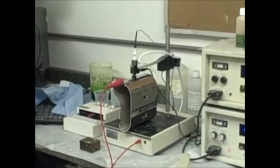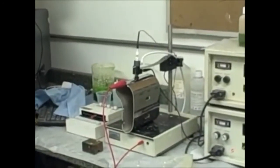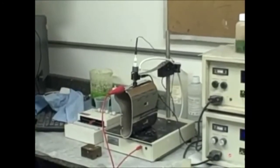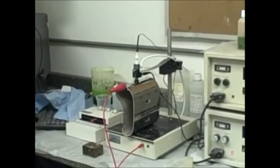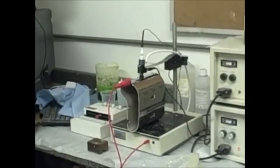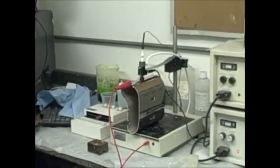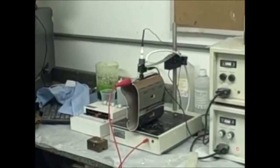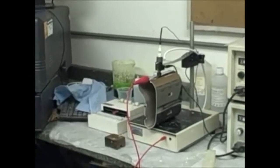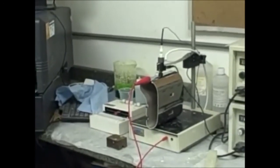This test checks the electrical potential and also the thickness at the same time. As the testing is going on, the report is printing out on the chart graph, and from there, once the testing is done, we actually read the chart and record all the proper thicknesses and make sure that it adheres to our customer specifications.